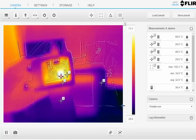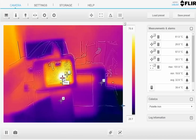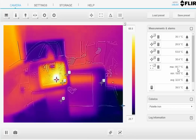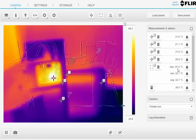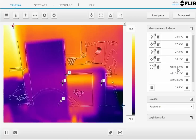Obviously the network part of it is not running anywhere near as warm as the other chip was before. Now the CPU is hogging all the limelight by being the hottest item. And you can see here that the maximum temperature is actually indeed 100 degrees. This does show that those figures pan out — it will get up to about 100 degrees inside a case. Now that I've taken the case lid off, it's actually starting to cool down a little bit. But it certainly was up there at about 100 degrees. Now that's running a stress test — in most cases you're not going to be doing that.